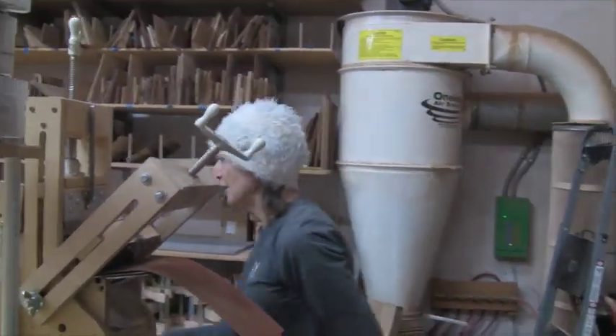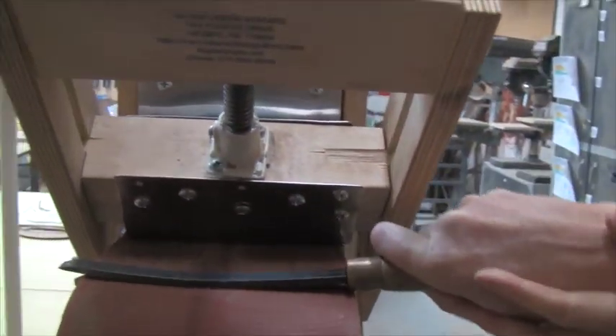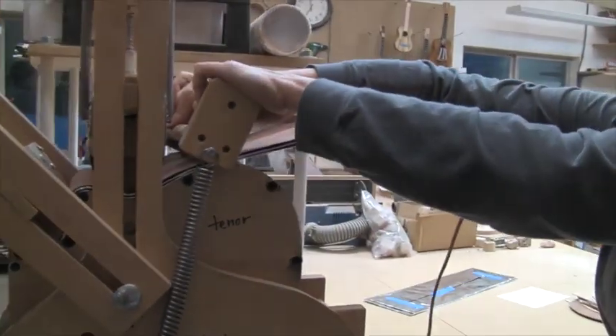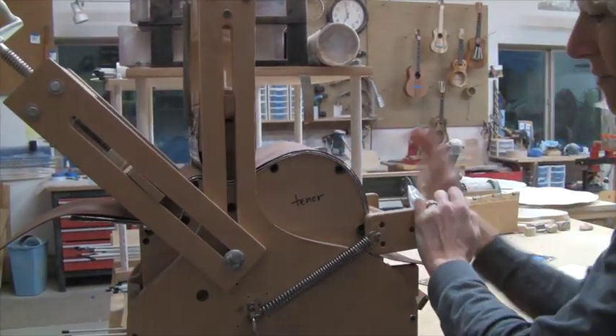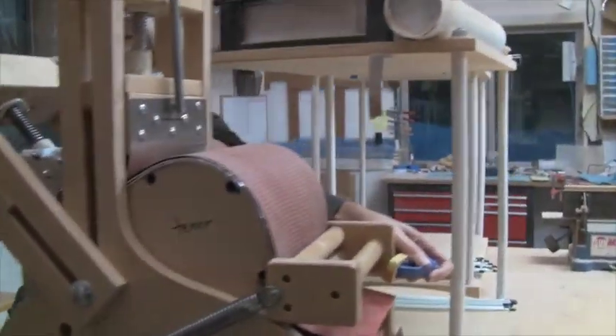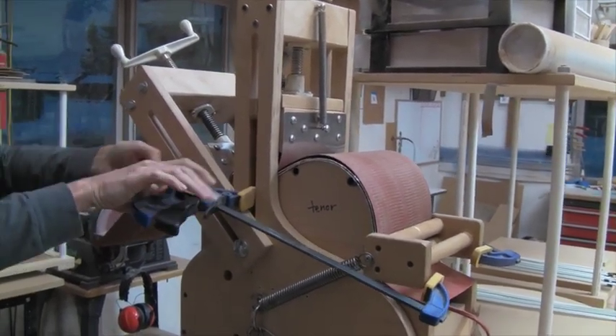I don't super tighten this down. You can see it's actually matching the curve very well. I'm using a metal tool here just so that this doesn't cup on me. Feel pretty good about that. Then the lower bout is easy. And then I'm going to clamp and pull that in at the tail, just so I don't get a flare out at the end. And there we go — the curve is bent, the side is bent. I'm going to let this rest an entire 24 hours so that it takes this shape and keeps it, and we'll come back tomorrow morning and take this out so you can see the result.